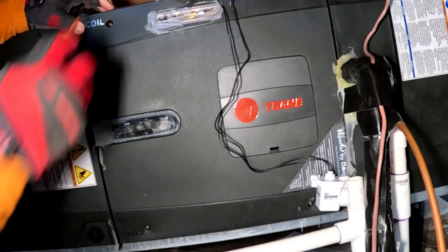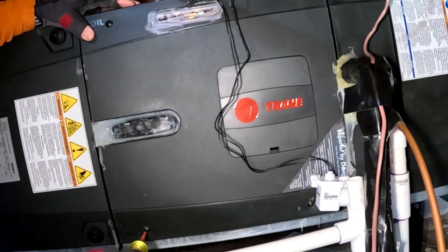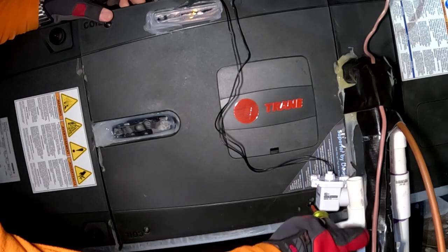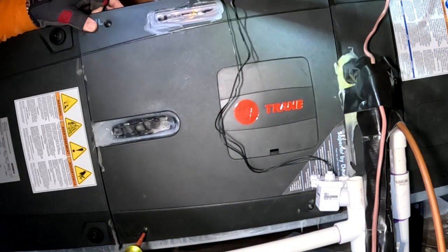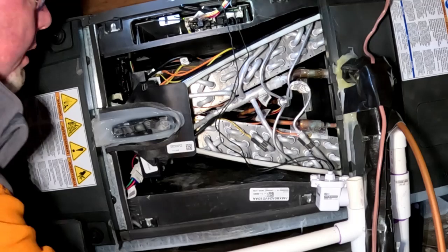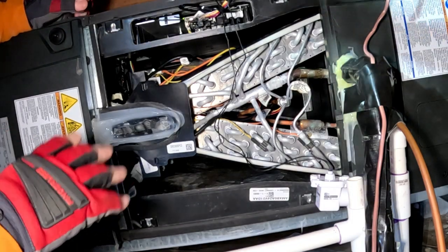In cold weather, below about 45 degrees, when this thing would defrost, sometimes it would snap out of defrost before it got down low enough to trip the low pressure switch outside — that was just because it was milder weather and it wasn't defrosting very long. But on the cold nights during the snowy weather, with 20-degree weather, it would stay in defrost longer.